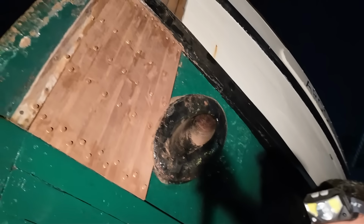It's just past 11 p.m. and I am now on my own. Boat's just about ready to go. I'm putting some bottom paint on. I still have to do some bungs, which I will chisel off after the bottom paint, and then if I have the energy, I'll probably put some sealer on the anchor guard. If not, that might be a project to do at anchor somewhere in the next week or so.